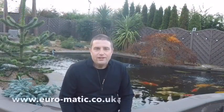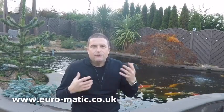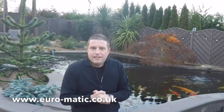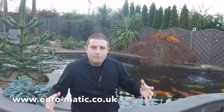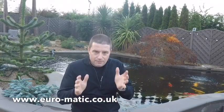Hello there. It's a very chilly November afternoon and I'm out here today to insulate my Koi carp pond. I have a large irregular shaped Koi carp pond that holds 17,000 gallons of water. I also have an air source heat pump that is perfectly capable of heating that volume of water. However, with a surface area of 50 square meters, the heat will evaporate from the surface faster than the heat pump can put it into the pond. So I need to insulate the surface of the pond to keep the heat inside.